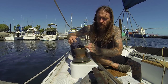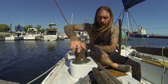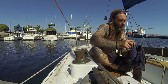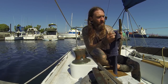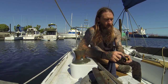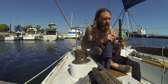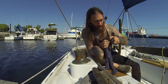Some winches, if they racked around a lot of dirt or had too much grease, would be real gunky, but these ones are pretty minimal. We'll go ahead and reassemble while we're waiting for all the parts to get clean. Just turn it — see it locks in like that. It's a little wiggly because I haven't put my plastic slides back in yet. Now you might want to be careful what you clean the plastic stuff with. I don't think diesel will mess with it, but I'm going to go light on it — not soak it in diesel. Acetone may eat this stuff, I'm not sure, but something to be aware of. I'm actually a little shocked there's plastic in these considering they're from 1965.